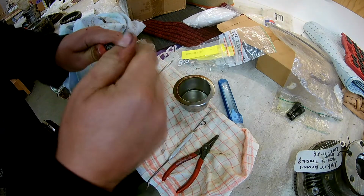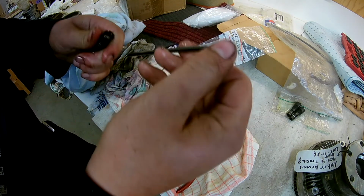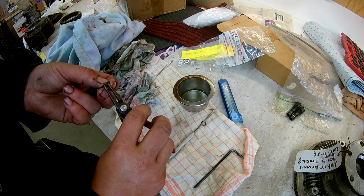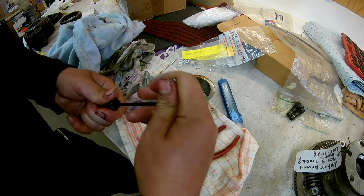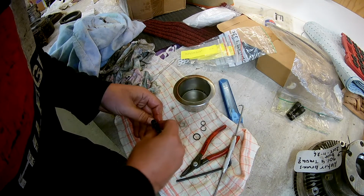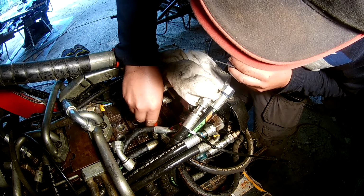So a new O-ring in place, and it was tightened back in with the spring and the cone regulator, and then the lock ring could be put back in place. I had counted the revolutions it was turned in before undoing it, so that it could be brought back to the same position backed out.